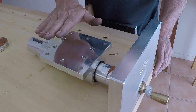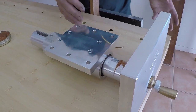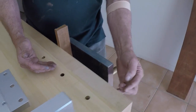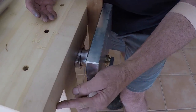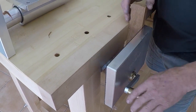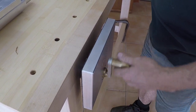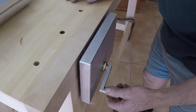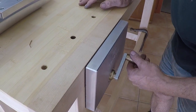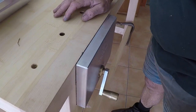The base plate is very simple and is perfectly square to the front of the vice. So if you make your bench so that the edge is square with the underneath section and flat, this vice will just bolt straight on. As long as you bolt it on securely, this vice will not rack, and as you can see it just winds up perfectly even all the way through.